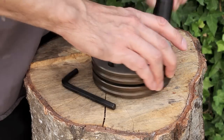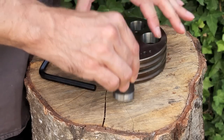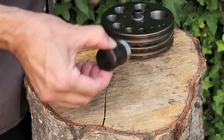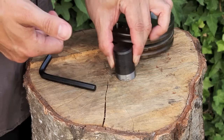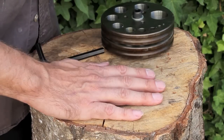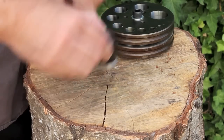Something else you need to consider is the surface you're actually cutting onto. The cutters go all the way through and will strike the surface underneath. You don't want to be cutting holes out of your workbench, but equally if you put this onto a metal block or an anvil you'll be striking your cutter into metal and that's going to damage it. I've got a nice block of wood here — a tree stump — or a piece on your bench, or maybe even a nylon or plastic cutting board.